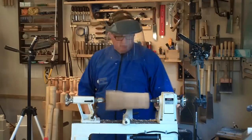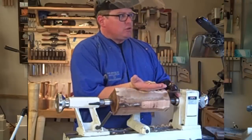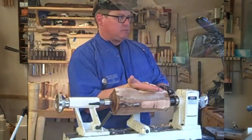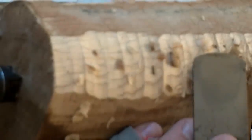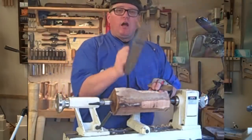Now I want you to see what's happening. The wood is getting chewed up in deep grooves. The chips coming off are going across grain — chips like that. Again, transferring knowledge: what tool do we use all the time to rough out and prepare rough stock going across the grain, creating deep V's and chips like this? Simply your scrub plane. Look at the blade — a deep wide U — and when you go across the wood cross-grain it creates these valleys. This is a roughing tool, the exact same thing as a roughing gouge.